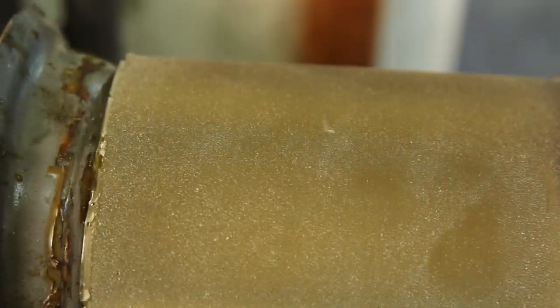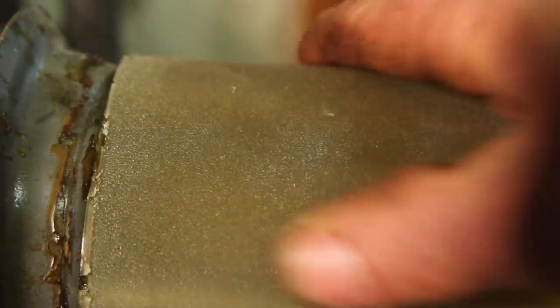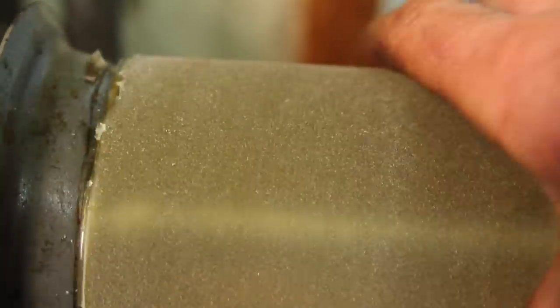So as someone who's done this exactly once now, my advice would be sharp tool, high surface speed, and lots of spring passes. And that'll give me a surface finish that's perfectly acceptable for what I need. If you were trying to get a nicer surface finish and hit a critical dimension, it might be a different story.